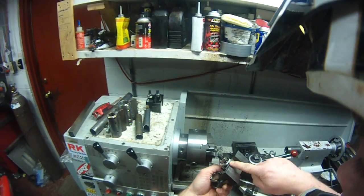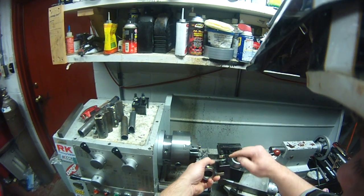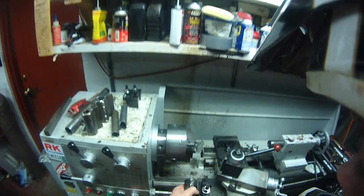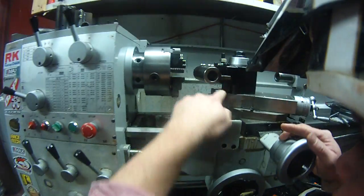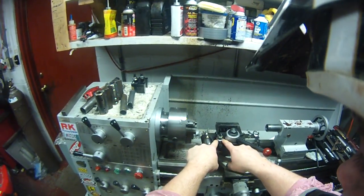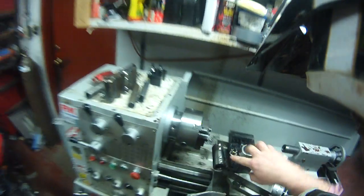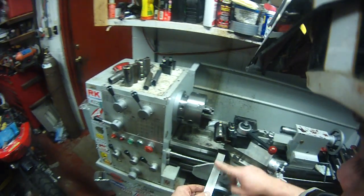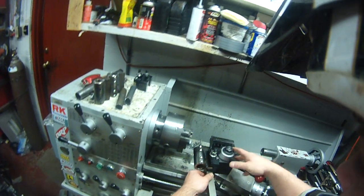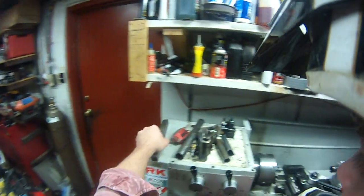I already have this zeroed out, but if you wanted to do offset notching, you just raise and lower it by adjusting the threaded knob. So that just drops down there. This distance here is set for it to be on center. The quick way to do it is just to take a piece of rod — this needs to be 0.980 inches — so just ground a piece of rod down that you could drop down right on there and it just indexes it.